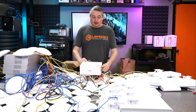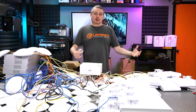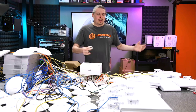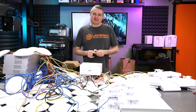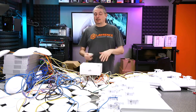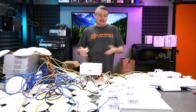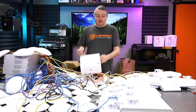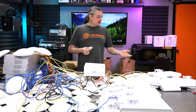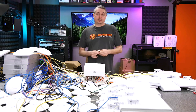People will ask: why UniFi AP LRs versus HDs? Simple — we needed high density because all those racks and cages hold a lot of metal parts, like gaylord-style boxes with metal cages, which saturate and absorb Wi-Fi almost like a Faraday cage. So we have a lot of APs going up and down the rows, but there aren't that many hi-los, so you don't need the HD UniFis. The AP LRs have plenty of range for the application. On the outside units, the Pros aren't much more expensive, they have good density, and they support a guest network for drivers. Hi-los sometimes go outside into the trucks, so these are placed around the docks.